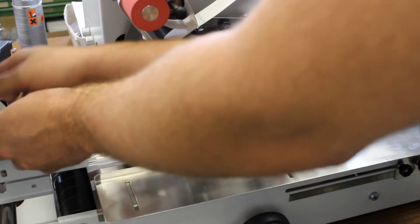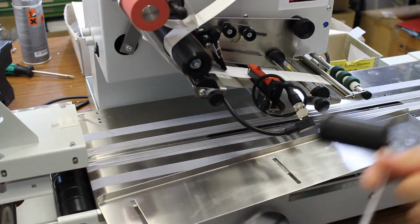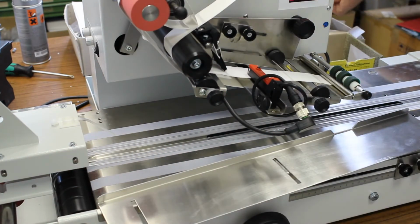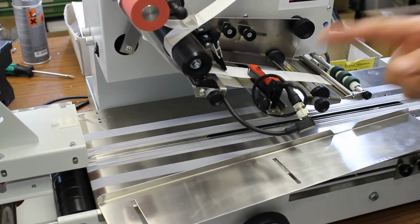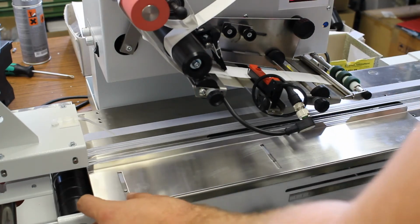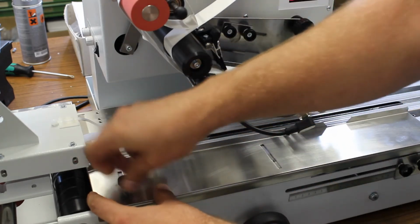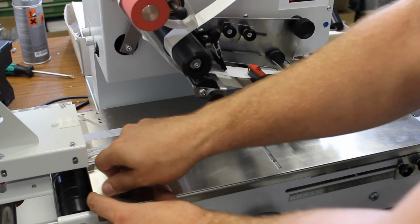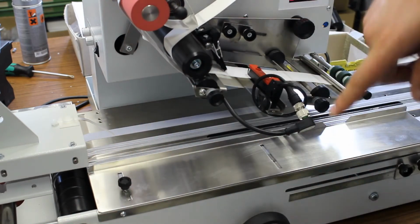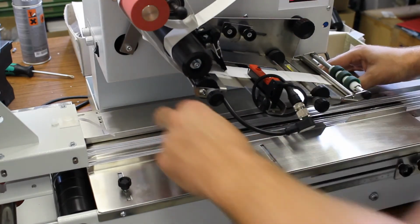This is an additional option, which are 2 additional plastic rolls which actually press down the product onto the conveyor belt. This is only needed if the product is very light and the weight of the product is not enough to keep the product in place. Here, as you can see, these are just connected with 2 screws. But we need 2 of them actually, one on the inner side and one on the outer side.